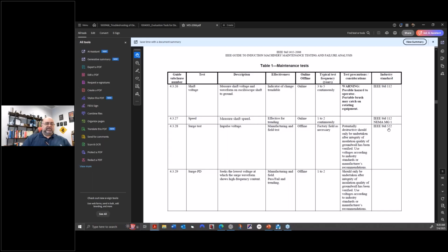And then this is an interesting reference, IEEE standard 522, because it is meant for coils. It's not meant for complete machines. There is no IEEE standard, or there's only one IEC standard that covers, let me correct that. There is IEEE 1068, which is out for comment right now. That's what I'm going to be doing after I get off here. Yeah, because there is no increase in losses, but we want to allow a 20% increase in core losses through a standard repair process, which works out to between 0.5% and 1% reduction in efficiency in a machine. But yeah, that's the battles we fight.